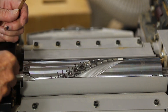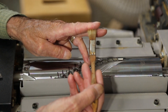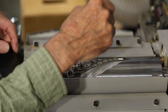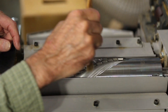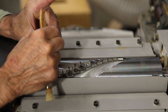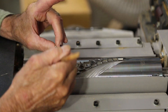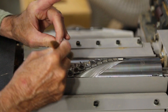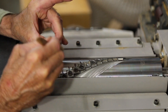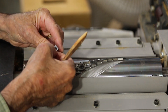I now pick that little insert, and I've taken just a cheap throwaway brush and cut the bristles off short, and I go in with that and brush all the dust out of that little pocket. I do the same with the carbide insert, brushing all the edges of it and getting rid of the fine dust that's accumulated in the last two and a half years. Also, get it out of the screw pocket.